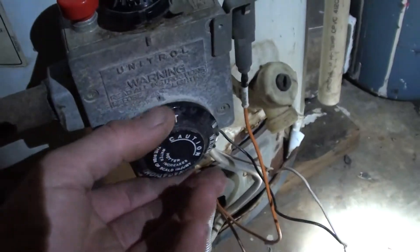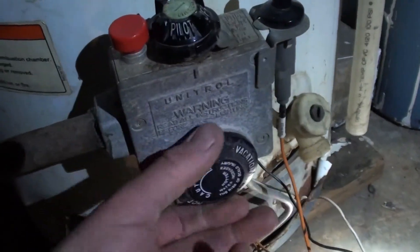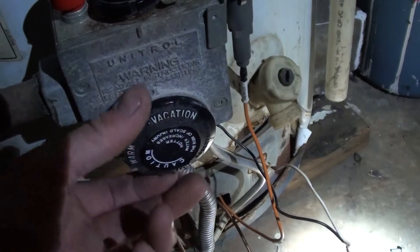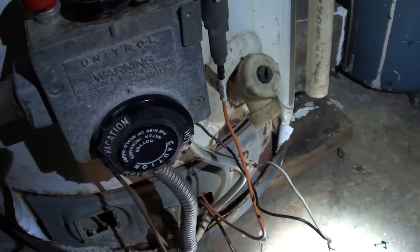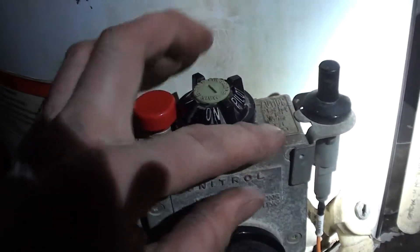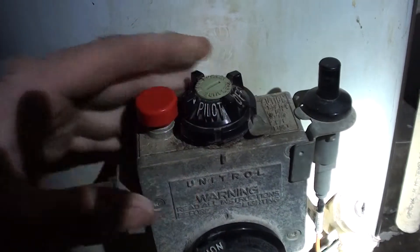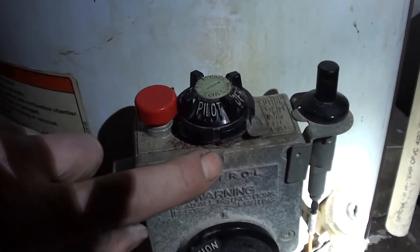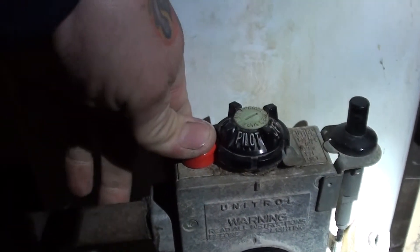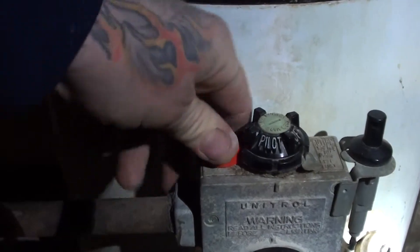So we're going to light this up. Show you here how to light it. Some of them you don't have to move this; most of them you do. This one doesn't really have a spot for pilot lighting, but you can turn it all the way until it stops toward the vacation setting. When it's in the on position, you have to press down on this to get that knob to turn. Get it to where it says pilot, line that up with that little tip, press in on the button — you've got to hold down on the button to allow the gas to go in. Then use your piezo igniter to fire the flame up.